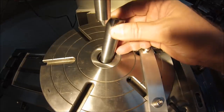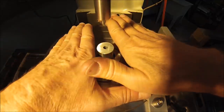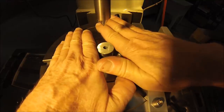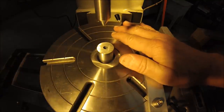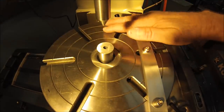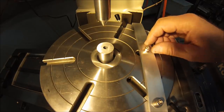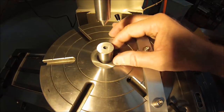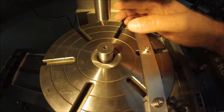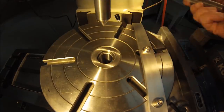Like I said before about the plug, goes down in here. And I usually put a sub plate on here, so if this is hanging out a little bit tall, you're going to say, okay, what's up? So if you have a sub plate on your turntable, which is a really good idea if you're going to mill perimeters, don't mill into the surface of your turntable. Put something on here, put a piece of aluminum on here, put a piece of masonite or plastic on there, because that also seems to be very rigid and very powerful to avoid distortion under the clamping pressure. There's the second way that you can locate a piece. Pin in the part. Done.